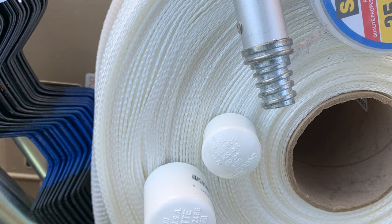Let's talk about the number of people. I've been on installs where there were 12 people and six of them were just standing around getting in the way. I've been to one with three people on a smaller house and that seemed to work out well. I really like to have at least four people for a 100-foot house, ideally six — that way you've got four people on the corners, one person to go around as the wiggle wire person, and one person in the center.